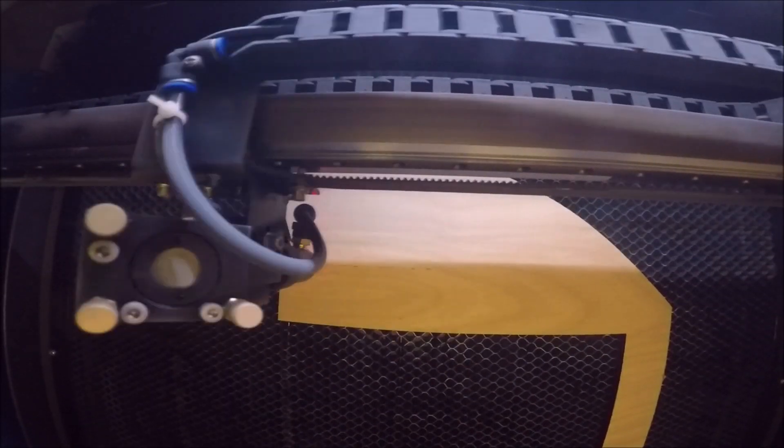What's a good YouTube review without a demonstration? Here you'll see me cut something I designed in Lightburn — it took probably two minutes to design. These engraving cuts were made at roughly 250 millimeters per second at 40% power, and I've sped up the video by 200% to keep it shorter.